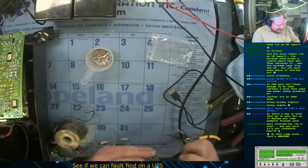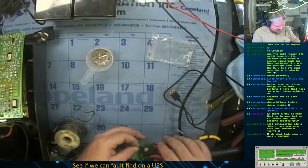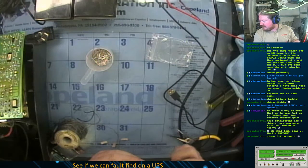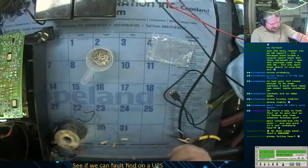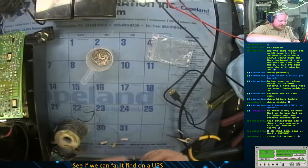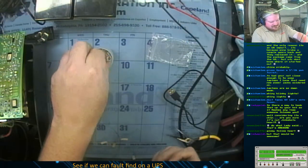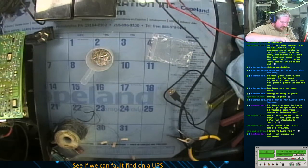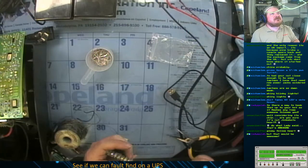Well, Lady G, I'll have to dig into the Twitch API to pull out the follows, because I don't think they put the follows in raw format in the IRC. And see if there's a way I can encode that into Arduino bot. And then it'll be my follow heart. Because it does run off of 5 volts, and so does Arduino bot, so... might have to tap it off of the 5 volts that I'm using for the strobe lights.